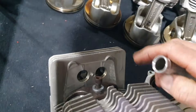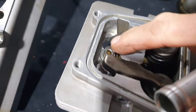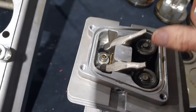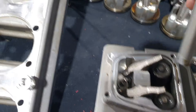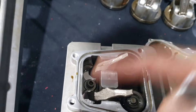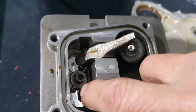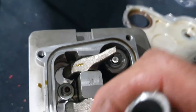The reason for the bigger diameter end is quite clever. There's a screw with a big washer on it. When you take that screw out, you can slide the push rod tubes in from this way. Because the top end is bigger in diameter and the bottom smaller, it'll just fall through once the screw and washer are missing. You can push it fully into the crankcase, get both sides in, do your adjustments, put your rocker gear in and all your plugs. Then you put the screw back in with a washer that eclipses the top and intersects the two circles, stopping it from coming out.